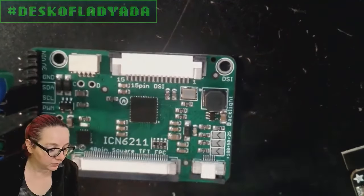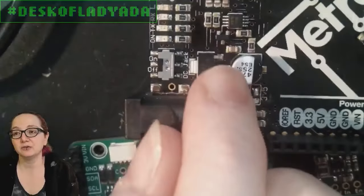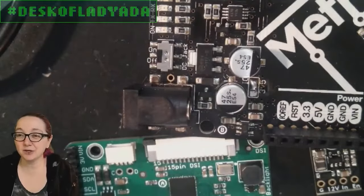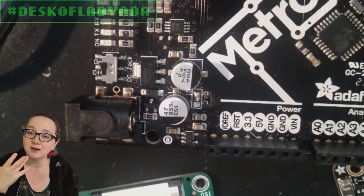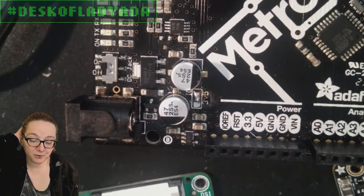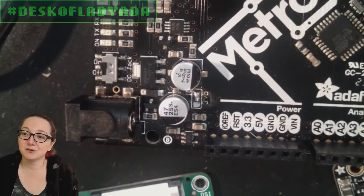And we sometimes use electrolytics, and there are times to use them. For example, when you need high voltage and a lot of bulk capacitance, this is 47 microfarad, 25 volt. For the pricing, you just go to electrolytic, but there's still a lot of 10 microfarads. Why 10 microfarad ceramics? Ceramic capacitors are inexpensive, easy to pick and place. They're small. They're very low ESR, which means that they'll perform fairly well at reducing high frequency noise. But mostly they're just really easy to pick and place and small.